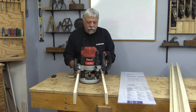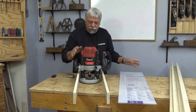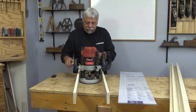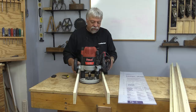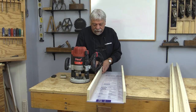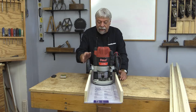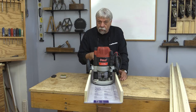The carriage is four pieces of wood with some plastic as a base. I need to cut a hole in it for the router to fit and drill holes for the router base. I had to measure the width between the two boards so the plastic can go underneath — and as it turns out, the piece of plastic I bought is just about perfect. I'll take the base plate off my router, find the center of the plastic, drill a hole, and fasten the router to it.